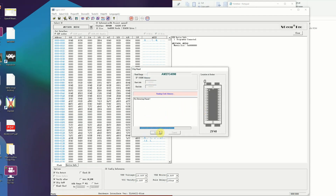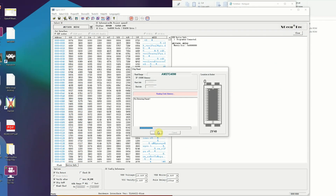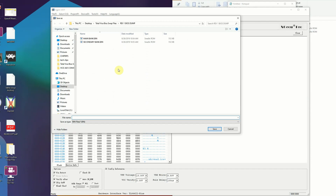If you take the dump from MAME, you get the main BIOS for the board, but the CD-ROM controllers are on alternative banks. I burnt a chip with just the information from the main BIOS and didn't touch those other two banks — I was able to boot the board perfectly fine, but I was not able to make the CD-ROM drive do anything. It did not receive power; it was unresponsive to buttons. So this way we're able to reproduce that BIOS as well as have full control of the CD-ROM. I did that off-camera — I was just playing around, not something I recorded. But it's been done and the chip's burnt. It didn't work, so I tossed it — no big deal.